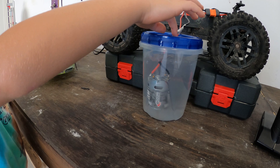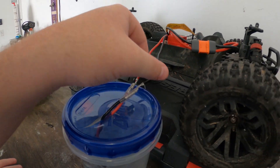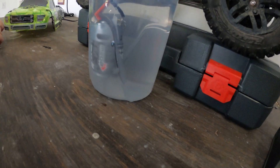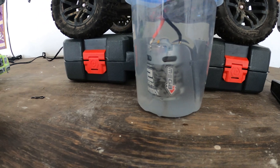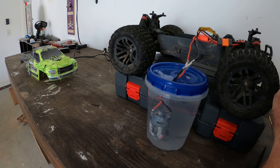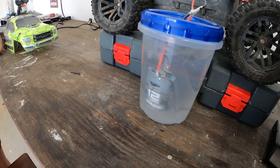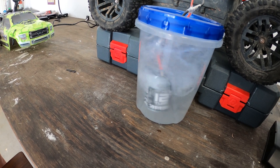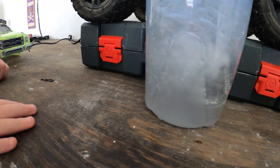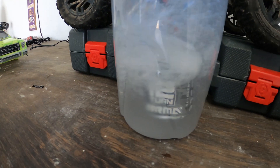This is your positive lead and this is your negative lead — it's a little hot. Guys, we've got about four minutes on this three-quarter cycle, so we're going to go ahead and turn the throttle trim up to full. Hopefully it won't twist our leads too much — we're doing just a little bit at a time. Looks like it's just spinning in a circle and not twisting the leads, which is a good thing.